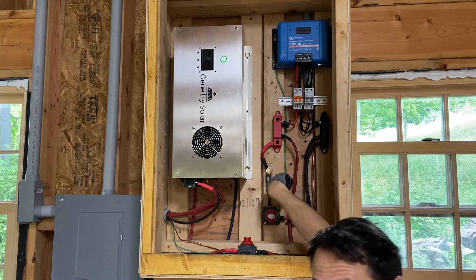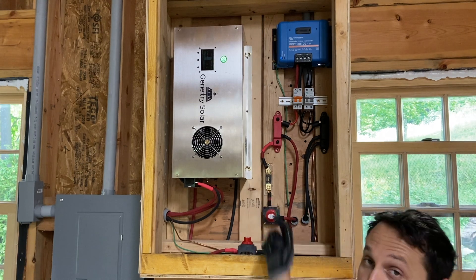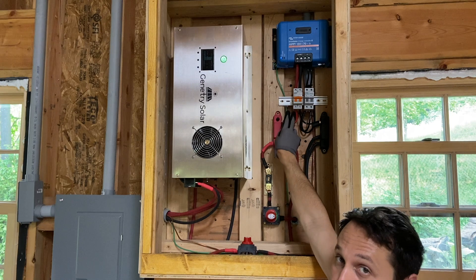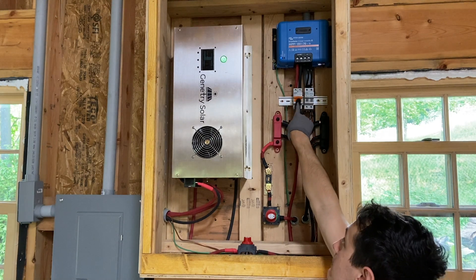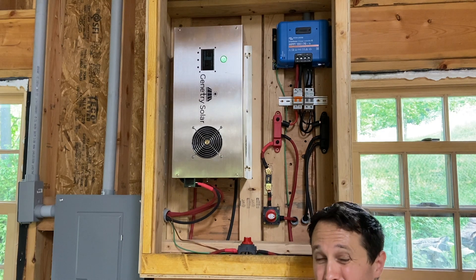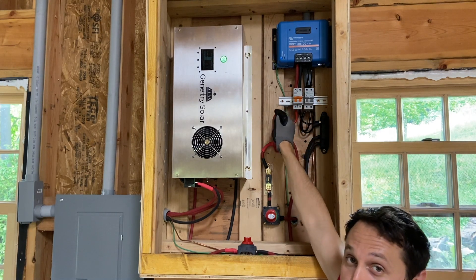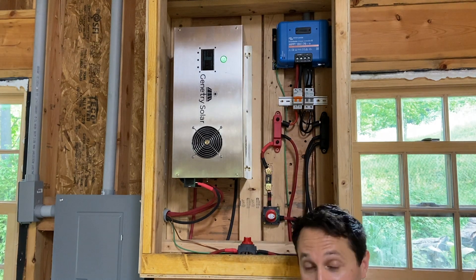This is just ensuring that I can disconnect the entire battery from the system, and also making sure that if anything at the system level goes wrong — a short circuit or something like that — I've got my fuse there to protect me. These are my main two bus bars. The solar power comes in here from these two wires. It gets fed to this DC circuit breaker — make sure that if you're working with DC power you're using a DC circuit breaker. This is a non-polarized DC circuit breaker, and that feeds the solar charge controller from Victron, which then charges the battery through these two bus bars. The solar charge controller is connected to these two bus bars and I can disconnect them both separately, which is really nice. I can disconnect just my solar panels and I can also disconnect the entire system. They're both on circuit breakers, so if there's some sort of issue on any of them, they'll get disconnected.